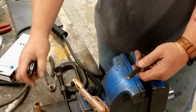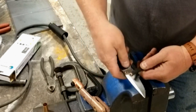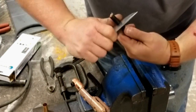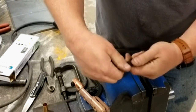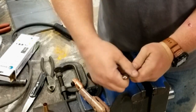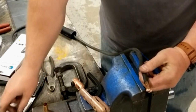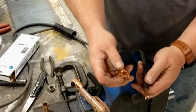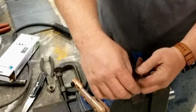The cable then needs to be stripped back. The length of this collar will give you an idea as to how much needs to be removed — it's not a lot. I'm going to use a common pocket knife. Roll the knife around the outside. Don't carve this off like you're whittling — you'll damage the cable and your knife. By making a light cut, I can then twist this; it will break the bottom of the rubber. You don't have to go all the way through — then simply pull this off. These cables are made of very, very fine wires — that's what makes them flexible, so we want to avoid breaking those. The flared end will help it slip over a little bit easier.